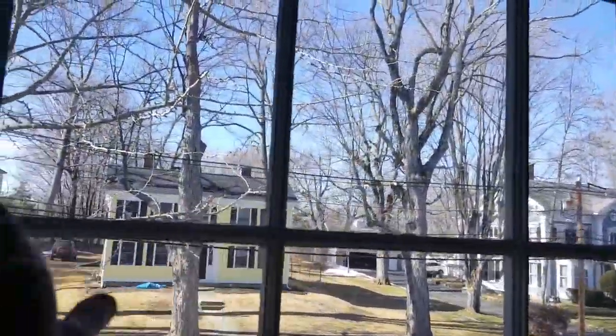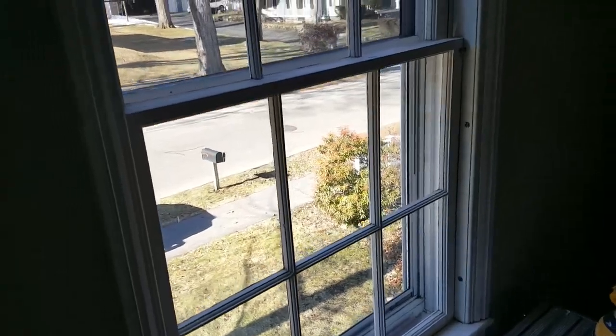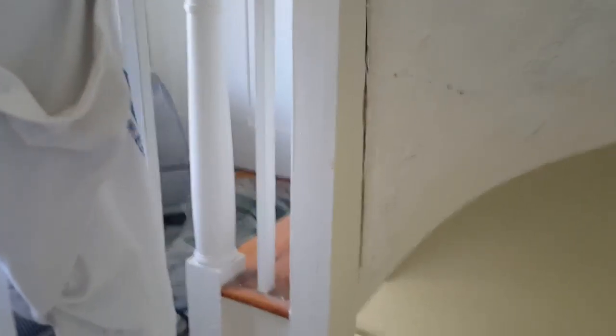In a formal living room or dining room with crown moldings, moldings and trim get painted first — that's a must. Look at all this sash — these are the old windows, I've got to paint all this sash. It's time consuming and you have to do two coats. It's going from white to linen white — linen white has a more creamy color and it streaks, you can't do it in one coat. All of the trim in here was painted with oil base, so you've got to sand everything.